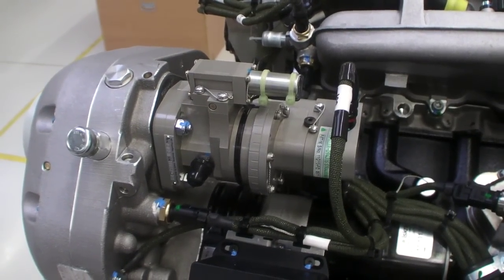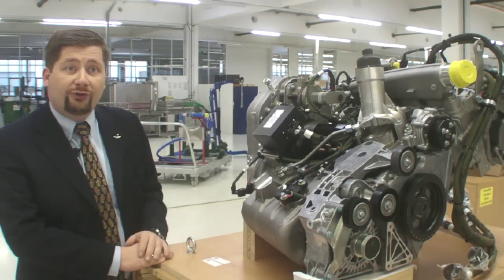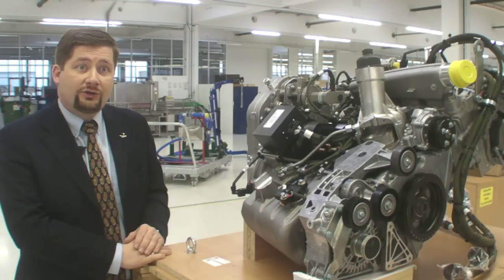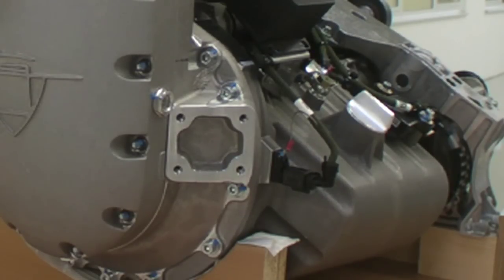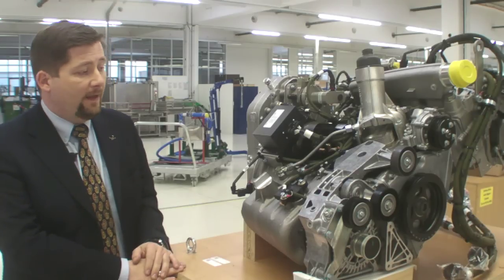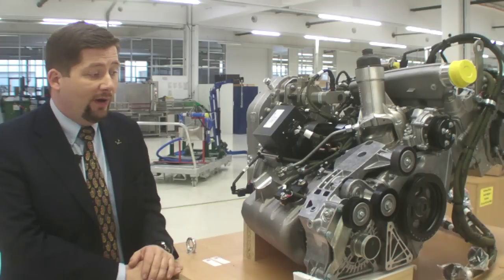All of this is handled by the ECU — the engine control unit — which automatically changes the pitch of the propeller in relation to the core engine RPM via a small stepper motor. The governor itself is a standard flyweight governor familiar from other engines in operation. The sump also needs to be totally modified, as the automotive sump size and shape was designed for automotive use. For aviation, special adapting of the sump and the suction pipe from the oil pump is required.